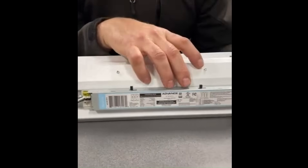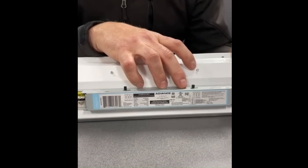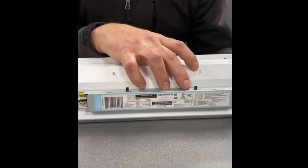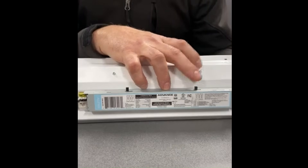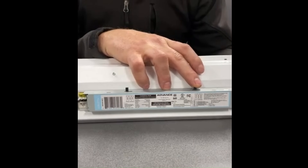For the color select side of this driver, we have three different jumps. Because this is being matched up with our modules, the jumps are from 3500K, 4000K, and then 5000K — so there are three different color selections.